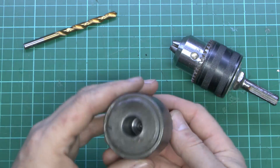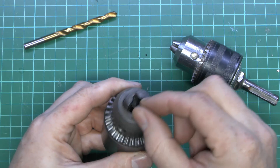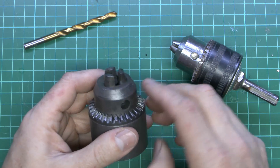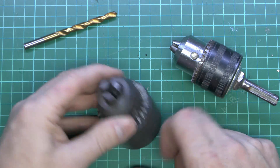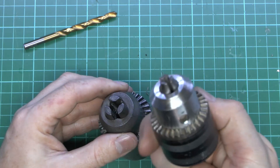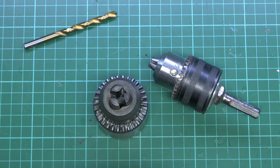So I'll buy another chuck with the correct taper to fit on the spindle and see how that goes. Clearly it's going to be better than this damaged one, because you can move the drill bit in there even when it's tightened down quite a bit. I think what's happening is that as you tighten it, it's moving off at an angle, which is why there's that horrendous wobble. I'll get another one — it won't be horribly expensive, bearing in mind that even the £10 chuck is still better than this clearly damaged item. But until then, thanks for watching.